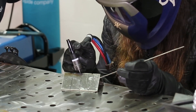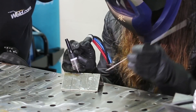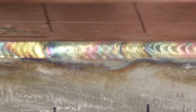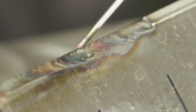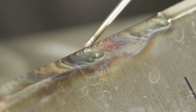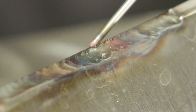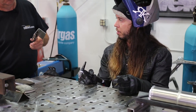That was running a little hotter on that one — right at 80 amps. I almost like that better as far as finish. For being able to round that off, I like that initial color too. This is a great technique if you're going to do a finish weld for something highly cosmetic. This type of technique and setting is going to save you a lot of time on the finish work. You just go over that with a DA, super fine grit, and finish it — it's going to help keep a lot of the warping out and keep your material flat.